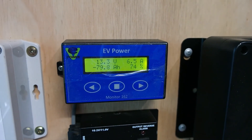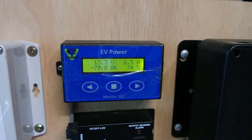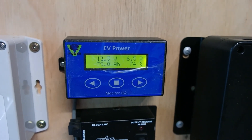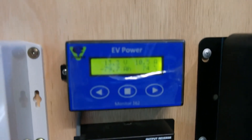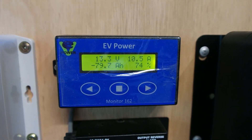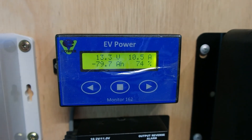So that's the cheap 250 watt — the heavy folding solar panel at about 18 kilos, a slug of a thing. Now let me swap over to the third panel, the 300 watt Sun Yi. And here it is — 10.5 amps. It quotes 23% efficiency on this panel, and these are not expensive panels, they're quite cheap.